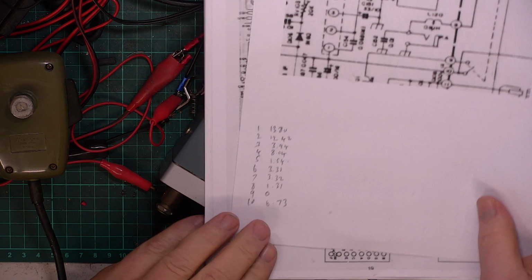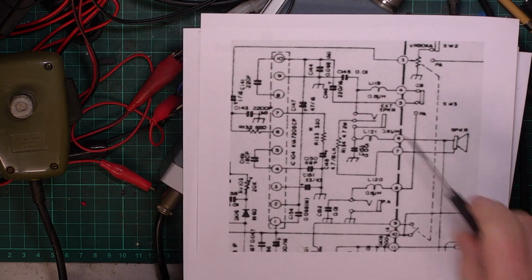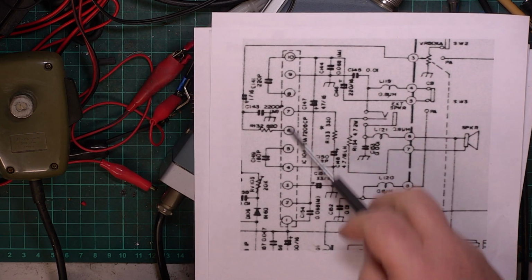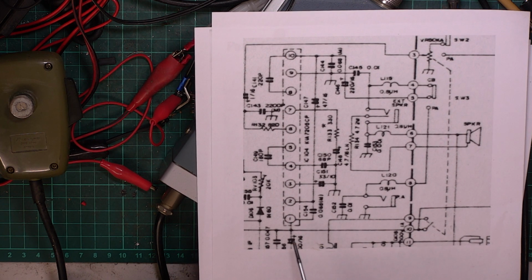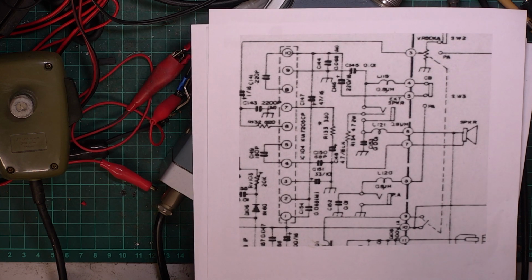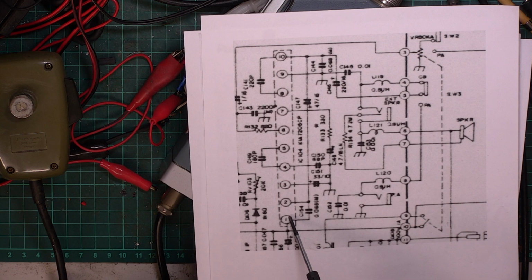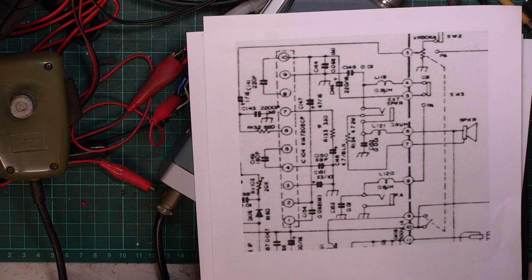And what I did is I've cut and pasted this part of the audio amplifier. We've got the KIA7205, and you can't put a TA7205 in without hacking about the printed circuit board. That might be alright for us, but it's not alright for a customer set. Now these chips are £33 something plus VAT these days, and so I had Mr. Chippy take out the audio IC.